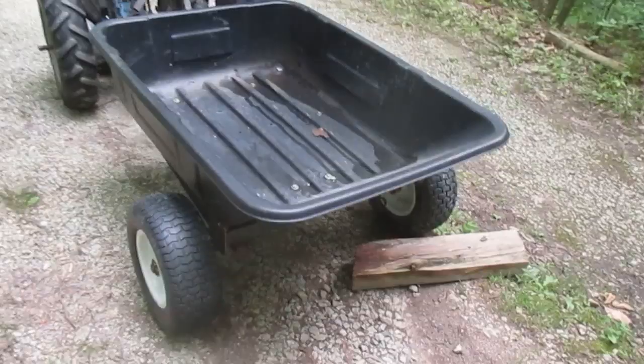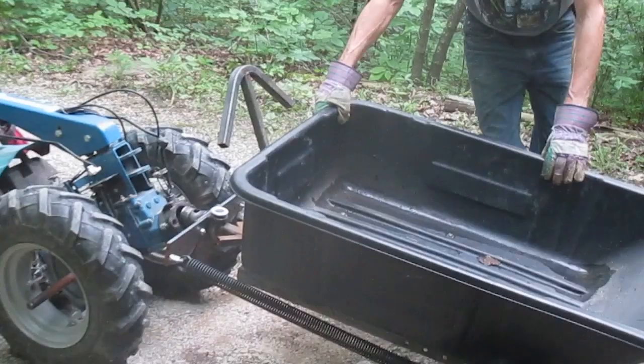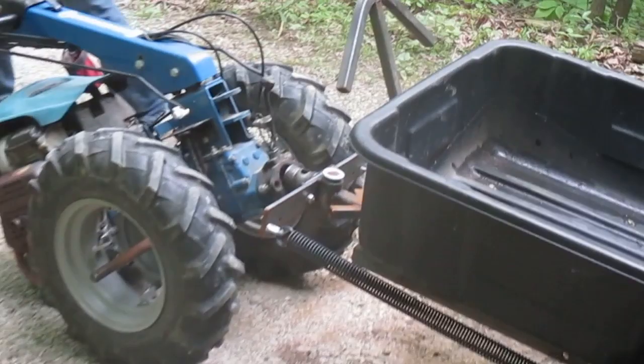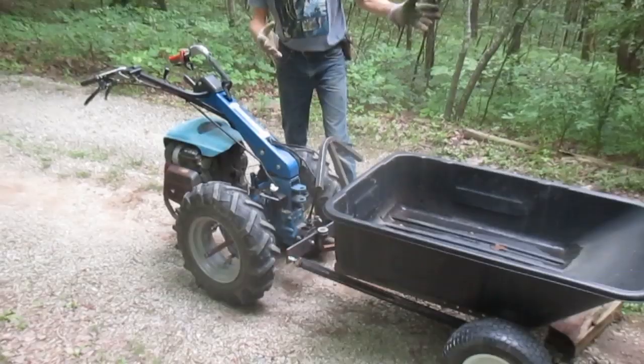and roll the tractor up like this. Set that thing up on the quick coupling like so. I did that the hard way. Anyway, shove that up there. Now this quick coupling is kind of sitting there. The cart can't get away. And I simply pivot this down, give it a little push forward, and voila, it's in the quick coupling. Drop the handle, make sure it's fully locked, and we've got the PowerBarrow locked on.